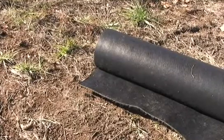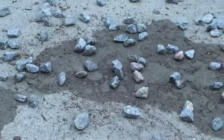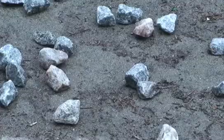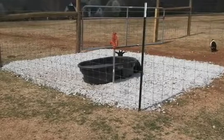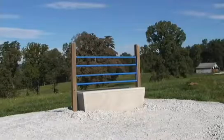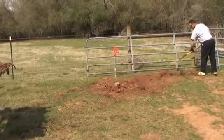A gravel heavy use area will require you to install non-woven geotextile first as a base. You never want to use both concrete and gravel. The reason being, if you install gravel on top of concrete, it will injure animal hooves. The size of the heavy use area depends on which species of animals will be using the watering facility area. Cattle typically need a heavy use area extending 10 feet in every direction from the edge of the tank or trough.